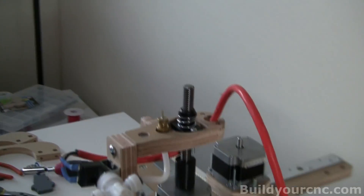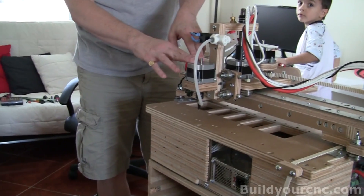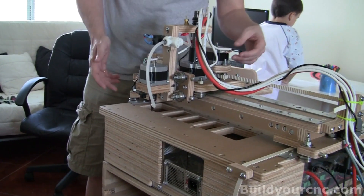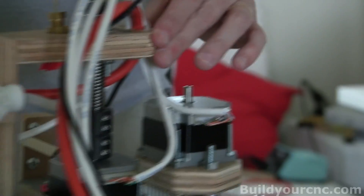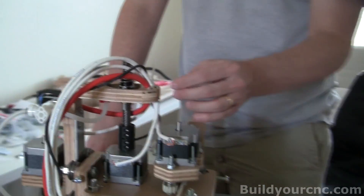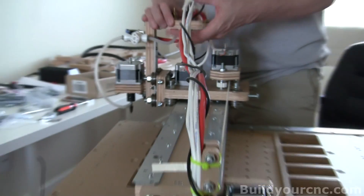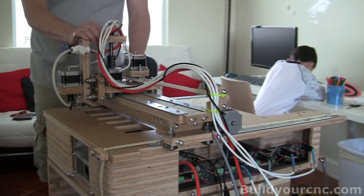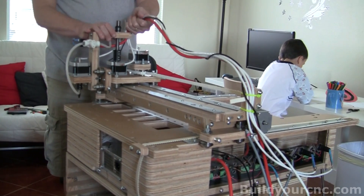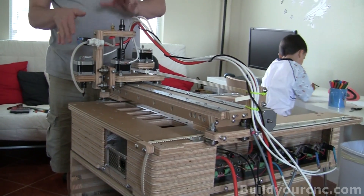This is the first one that's going to come through. We're going to be hooking up the motor wires and feed all the motor wires through the same hole. The motor wires you're going to get are already going to have wires — I had to solder these on because these are motors I had for a while. The wire goes through this little section here on the Z-axis anti-backlash nut mount. We've wire tied it in the front — that's what these two holes are for. Make sure you have the full travel with the wires but not too much; you want a tiny bit of slack. We're going to be putting another conduit on this area so it keeps all the wires together and doesn't bind.